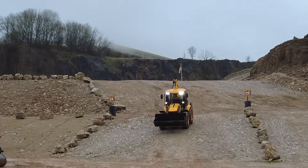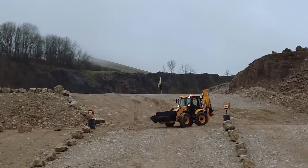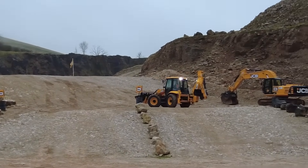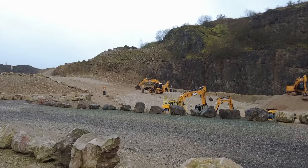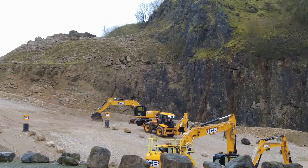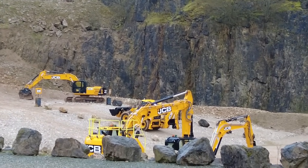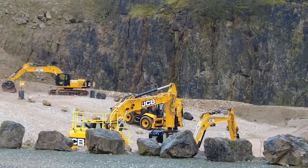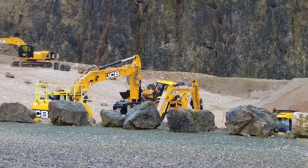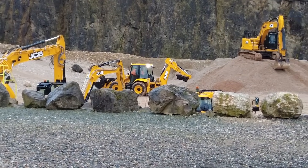It's not designed to be driven like that down the road — it's an off-highway thing. It makes the machine capable in tight areas and improves your manoeuvrability. We do see customers using it for ditching down the side of the highway — you would operate in ditching mode over the side of the machine. Or maybe if you're flail mowing, you'd operate in the reverse direction so that you're looking at your cutting edge, your working edge. We've had a number of enquiries for that already.